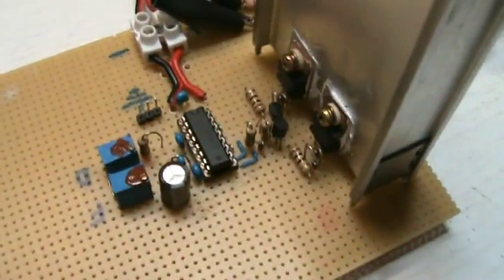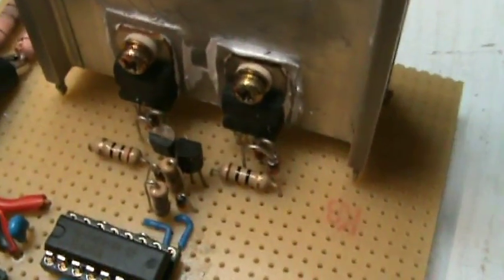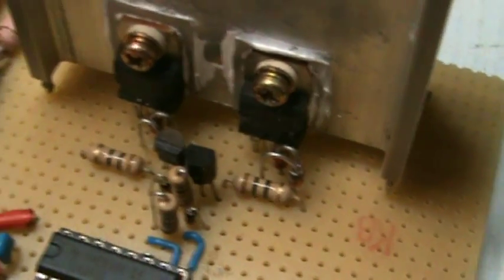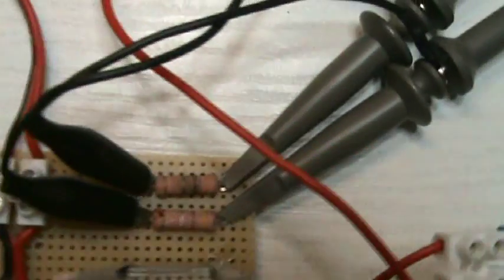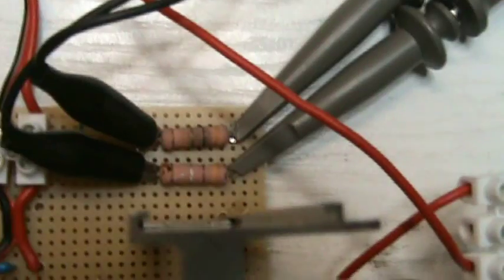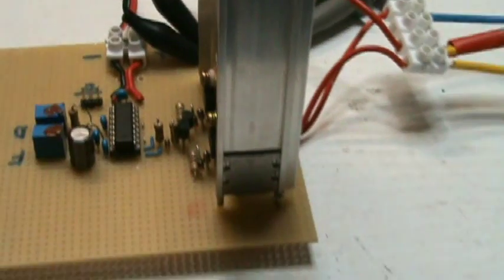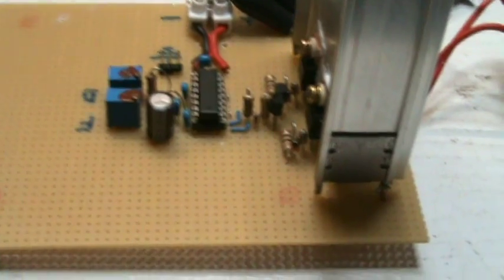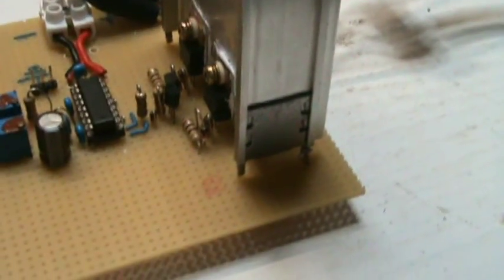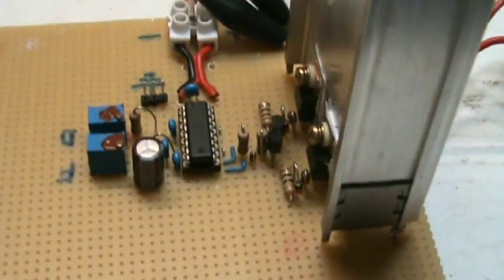And the circuit kind of looks like this. I have here both Zeners. Not sure if you can see it. Close to the MOSFETs. These are the current measurement resistors. They're getting kind of hot because I'm pulling 7 amps or something still. But I think these 17 volt Zeners also get very hot still, so I'm not sure if this is the good solution. Perhaps I can get some advice.